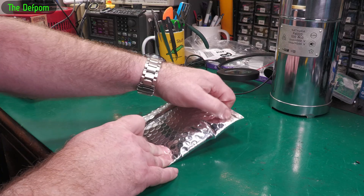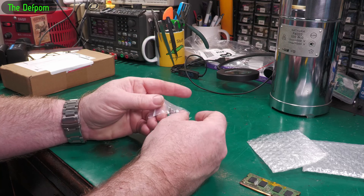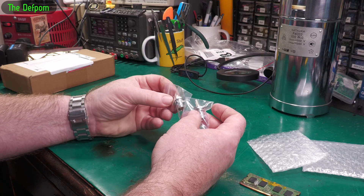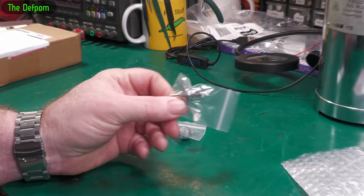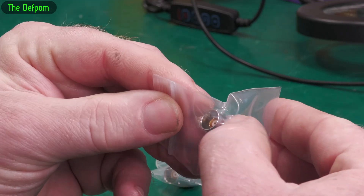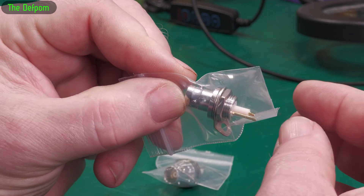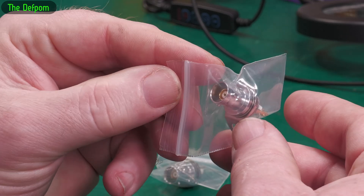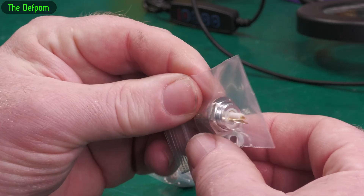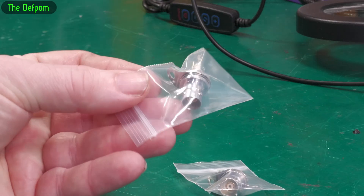Another item just arrived - let's add these on. These are some triax connectors, both the same. I need one for one of the meters I'm repairing - actually a two-lug triax, though I think I've got one in common as well. Three connections as you'd expect with a triax. This is potentially for my Keithley 220 - the triax connector on that is a little bit dodgy - but I'll get some spares. These were actually relatively cheap, so that's good.